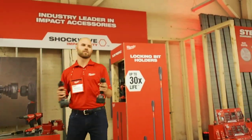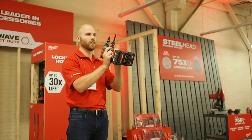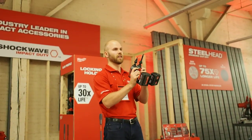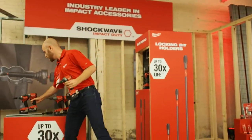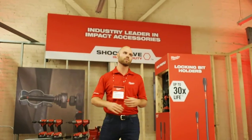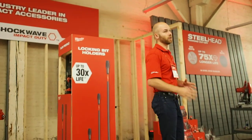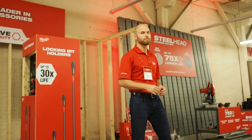This is going to give us that necessary reach for completing those common fastening applications like that conduit clamp, or fastening the gang box to the steel studs, or even that conduit coupling to fasten that EMT into the gang box. So this is going to launch in November of 2016, and it will also have a complementary SKU, which is going to be a replacement blade SKU. So again, in November 16, your users, or your readers, will be able to get their hands on the best reamer in the market that can both ream and fasten with one accessory.